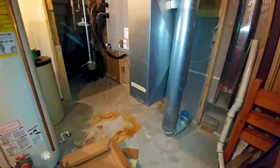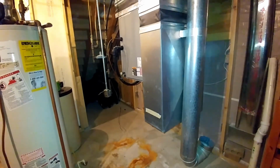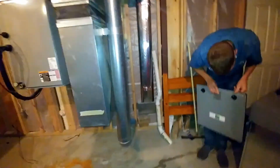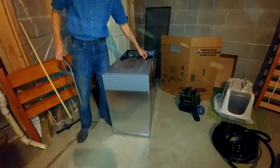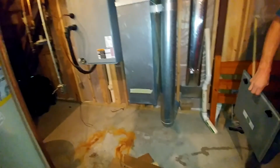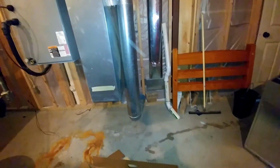I did have one that clearly the homeowner ran without a filter. I believe it was the same furnace. I think I've had 2 of those cracked over the last 10 years, but directly related to either the homeowner not having a filter in there and we got dirt in there and it overheated and cracked that way. The other one was my fault. It was just like this.